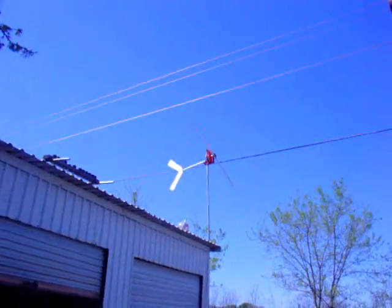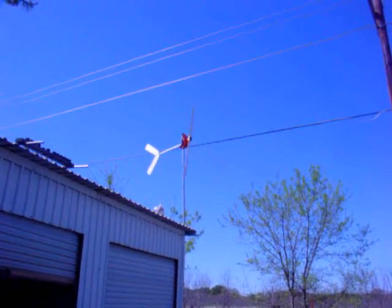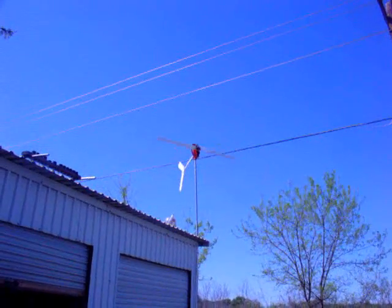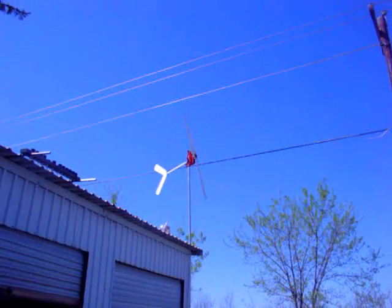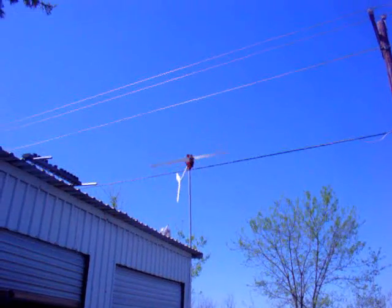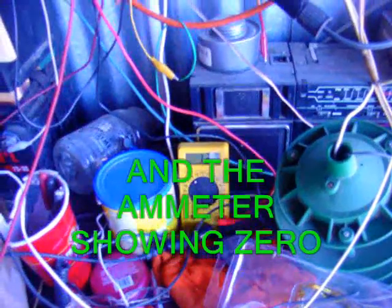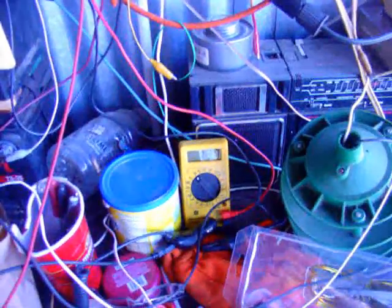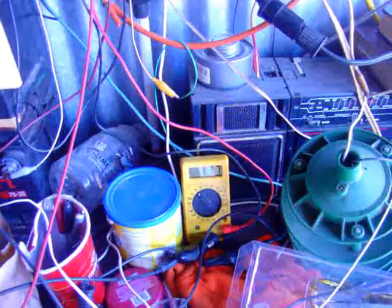Hello, I'm Scott Brown with Green Wind and Other Home Energies. From the direction of the building and the way the pole is leaning, you can tell that pole got bent again — a little bit more than last time. It's a bigger prop and the wind wasn't nearly as high, but a bigger prop takes on a whole lot more wind swept area. It was freewheeling when I got here. The first thing I checked was battery voltage: 13.7 volts, dump load not going off, and the way that thing sounded out there — the wind was really kicking.